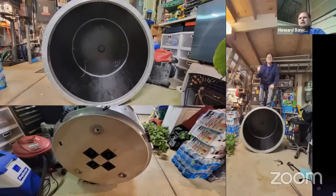Here you'll see me standing on my tube testing the strength — it's rock solid with the new aluminum rings. No flex at all. That primary cell is just solid as a rock. You can also see the baseboard where I have the three points for the mirror cell support. I used recycled vacuum valves that had a ball screw for closing massive vacuum pumps from the semiconductor industry — those were a freebie. No backlash, no shift. They work really well.